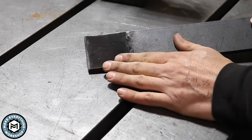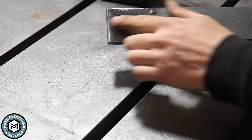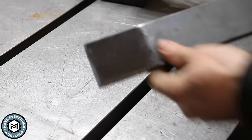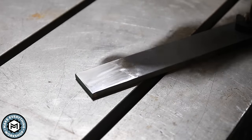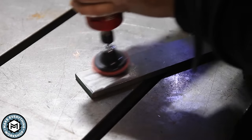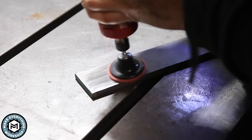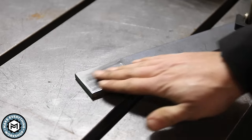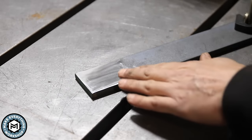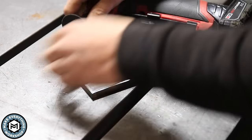This might look like a mirror polish, but let me show you — up close you can see it might look mirrored, but there are still a lot of scratch marks in it, and that's not going to fly. We're going to turn our grinder down to 10,000 RPMs for this step. You can see how those scratches are getting less and less, and there are a lot fewer grinder marks. We can pull that one off and move up.